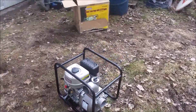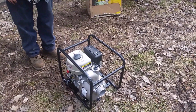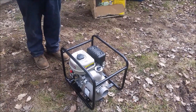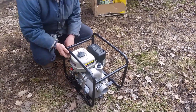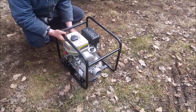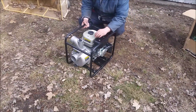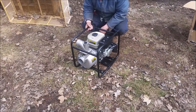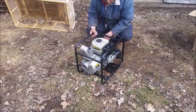This is model PT70400. It says it will pump 16,000 gallons per hour, with 13,000 gallons per hour rated flow with 100 feet maximum total head. It looks like it's 20 feet for suction lift. We're going to be pumping from the back of the pickup truck to the top of the manhole on the dairy tank.